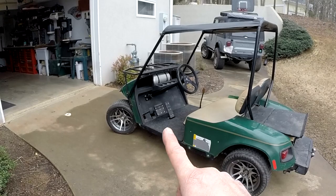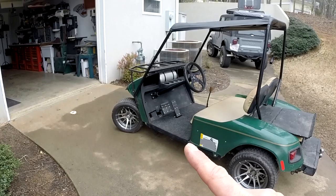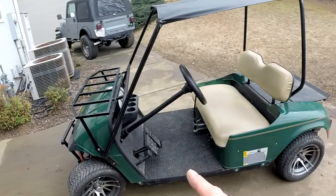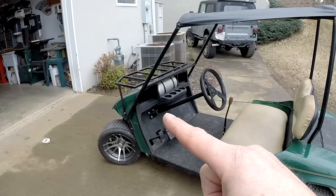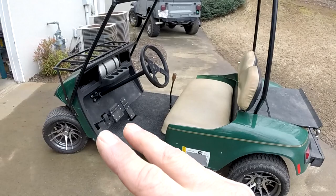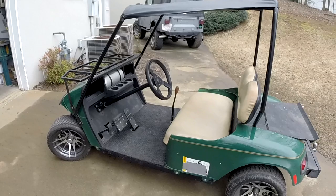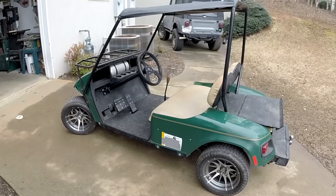What I've done as far as the overall configuration is, I did cut the frame right down the middle and added six inches. What that gave me is more leg room to drop my seat down. The seat is about six inches lower. I also lengthened the frame, and the steering here I flipped upside down — so instead of sticking up, it's laid flat. So you sit in it like a car, with your feet in front of you and the steering wheel in front of you. Having the driver position lower and your feet forward lowers the center of gravity and gives a more sporty riding position.